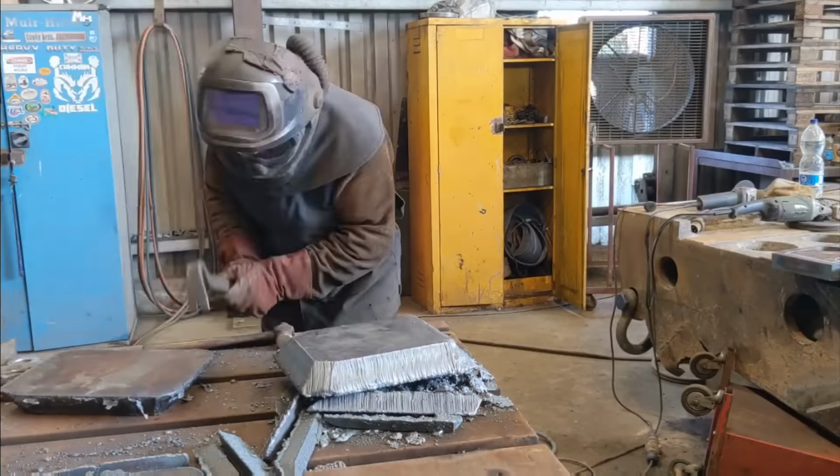The little feed rollers, this little roller runs on a brass bush, or in this case it used to. Whenever you put a new one on, put a little bit of grease or oil or lubrication, but eventually it wears out. Partly what contributes to it is your spring tension to clamp the rollers together. Ideally you want to have the spring tension set as low as possible to have a minimum load on these little axles, but of course you have to balance that with the traction, the gripping ability to actually feed the wire. So you want the minimum amount of spring load to feed your wire. The less you can run, the longer these little axles wear.